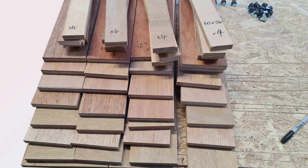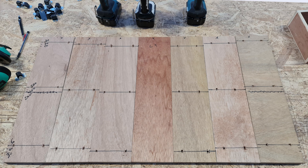I then cut the 16 spacers for the sides. I wanted to glue and screw the pieces together for maximum stability and ease of assembly, but I also wanted to avoid any screw clashes, and so I marked out and drilled the holes as you can see to stagger the screws.